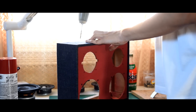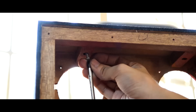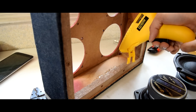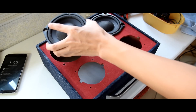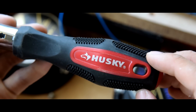Now let's add a shiny handle. Originally the handle was made for cabinets and drawers, but it also works for our boombox. So I decided to use this cool aluminum handle. Now it's time to mount the components. Here's a simplified block diagram — just refer to it throughout the assembly. Start by hot gluing the battery to the enclosure, then mount the speaker drivers in place.